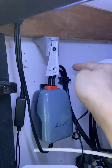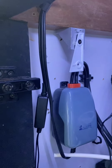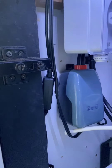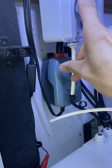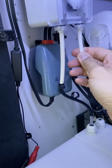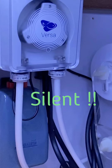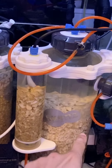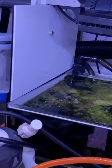Ideally the bracket is mounted directly onto a wooden cabinet, but because I don't have space, I've just mounted it to a bracket here and slip it in. This is my tubing going in on one side and out on the other. Right now it is set for 140 mL per minute. It draws water from the sump, goes through, and then it feeds the calcium reactor, and comes out over here.